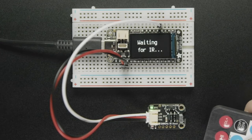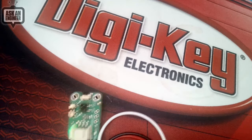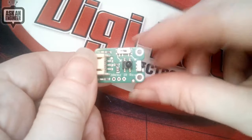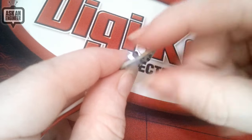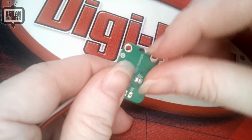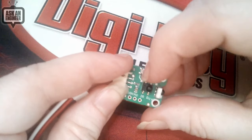There's a little red signal indicator LED to let you know when a signal is received. There are two receivers on the board — you can select between them depending on whether you want horizontal or vertical coverage. On the prototype here it's green, but otherwise it's the same chip. One receiver is vertical and one is horizontal — maybe you want something edge-mounted pointing out, or flat against a wall for maximum horizontal plane coverage. You can't connect both receivers together because if they have different signals they will fight each other, so you select which one you prefer via a switch.